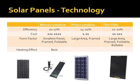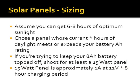What's the lifespan of a solar panel? Does anybody know? 25 to 30 years. Close. So a good quality monocrystalline can be 20 to 30 years, that is right. However, at that 20 to 30 year period, you're only getting 70 to 80% of its rated energy out of them.